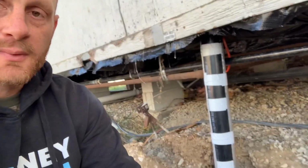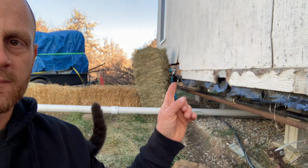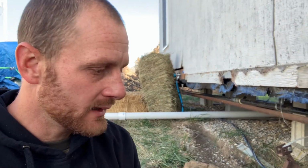That main line has what's called heat tape. It's a heated wire that you plug in and wrap around your water lines, and it's supposed to regulate the temperature of that wire to keep those pipes from freezing. So we're gonna see. We don't really know where it froze, but it had to have been from here into the house, because back behind me we've got that water spigot that connects to the camper. We're actually getting a heated hose for that, because it's going to get a lot colder than it has been, and we're blessed to have some nice weather for the next few days.